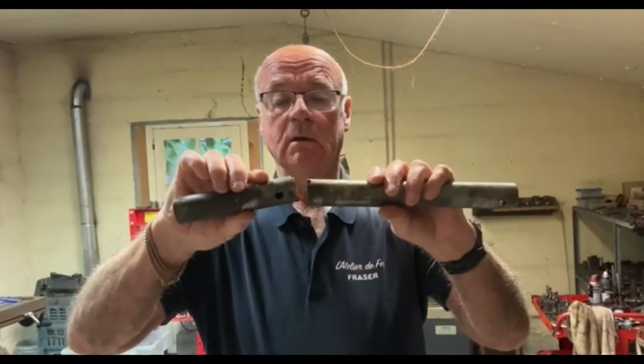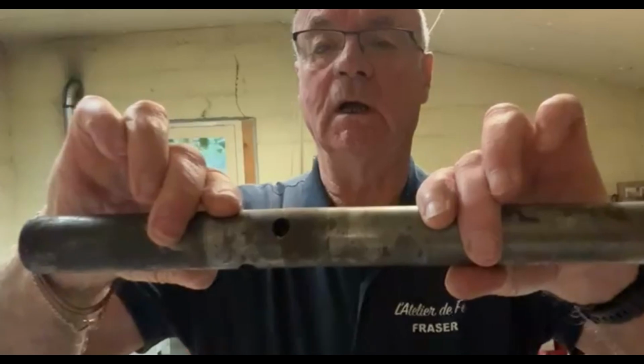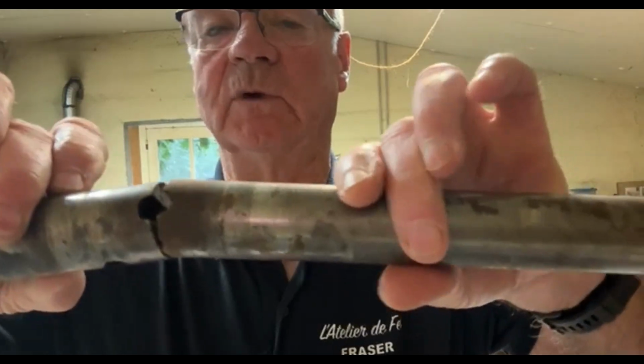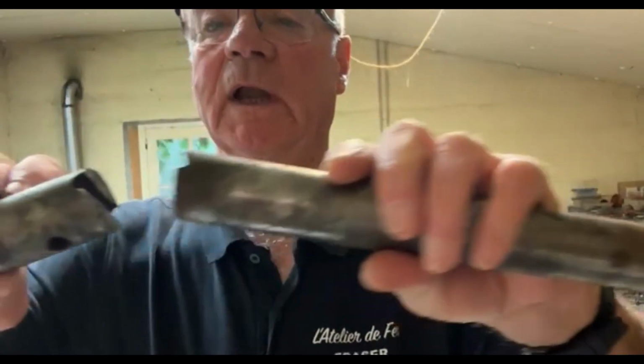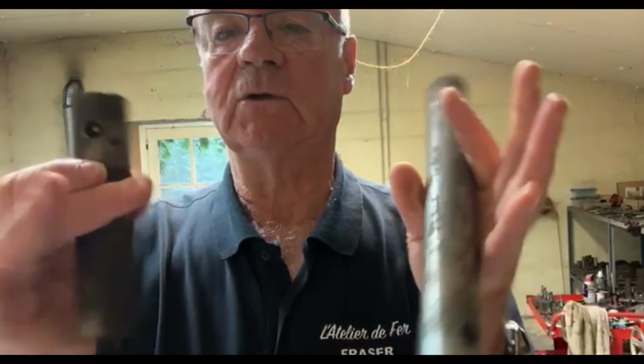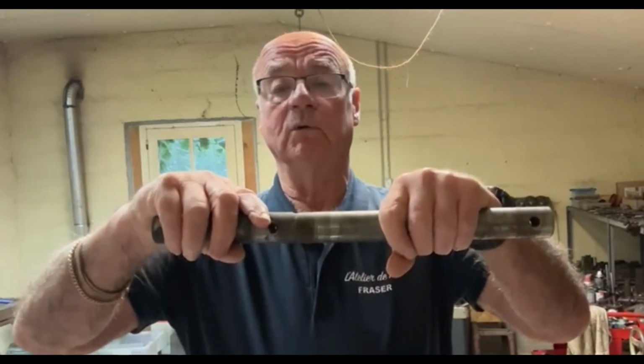I've got a little job on today where a farmer has brought me what used to be one shaft. It's snapped, as you can see. There are two holes in it that are supposed to be 90 degrees to each other, and obviously there's a clevis pin hole in the end, or an R-clip hole, whatever you want to put in there. I've got to make two of these shafts. Pretty straightforward job. The only difficult part is getting these two holes to be 90 degrees to each other, but that shouldn't be too big a problem. Follow me in the next few frames and see how we get on with this job.